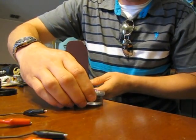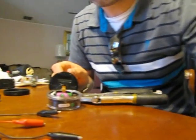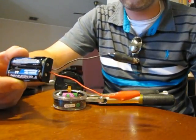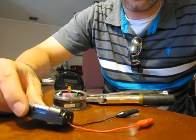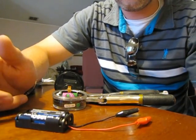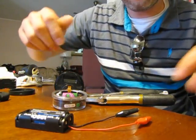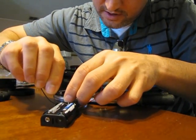I'll flip this around to give you guys a better view. Now this is my little power supply that I built — pretty simple, just a 2 double-A battery holder with positive and negative alligator clips, and that'll supply 3 volts. This battery is 3.6 volts so it'll have enough. Put them on like that — that's pretty good clamping power.